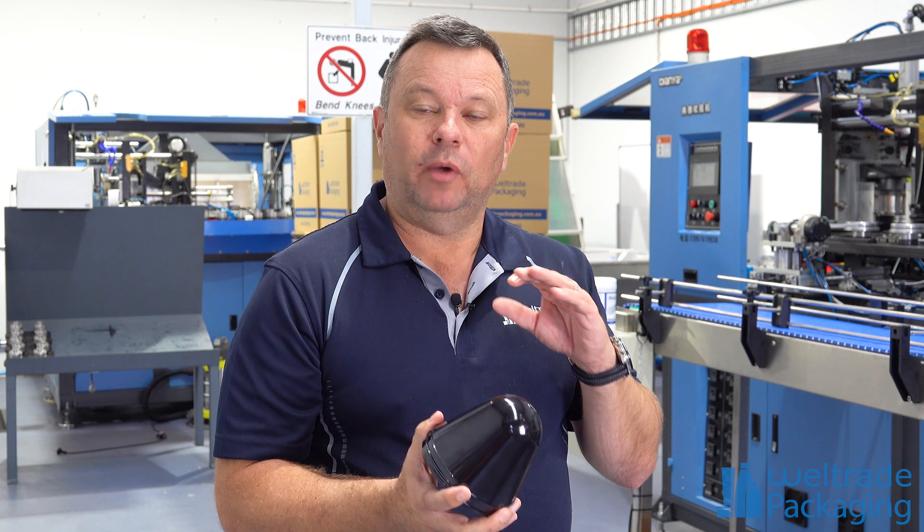The reason I went into two-stage PET is to make it easier for you guys. We wanted a way that you could set up and blow your jars as cost effectively as possible. The old single-stage machines that a lot of other guys are making are quite expensive — each different shape or unique design can cost a fortune. Our process — the molds are generally under $5,000 — so we can give you something unique at a really good entry point to the market, and they're still competitive in terms of jars, production, and speeds.